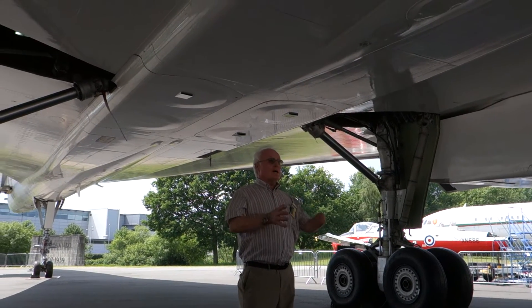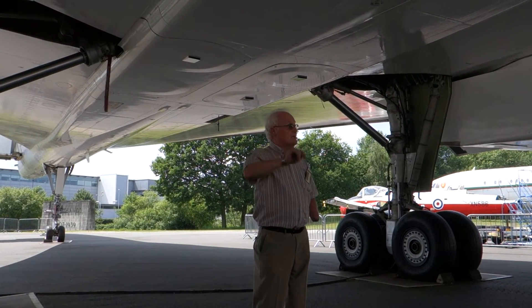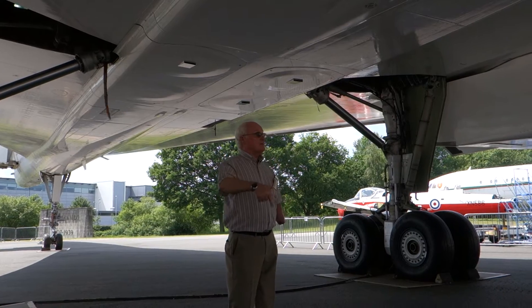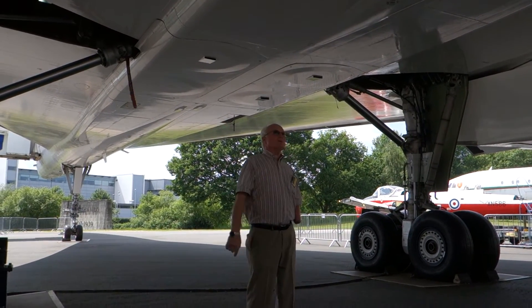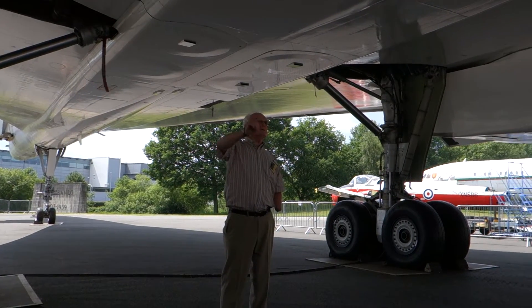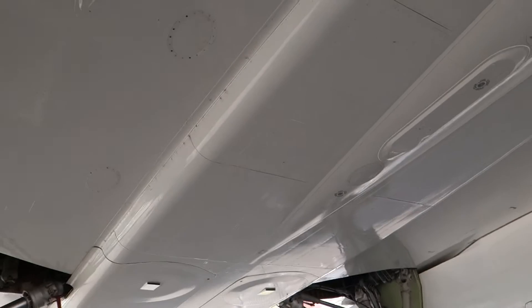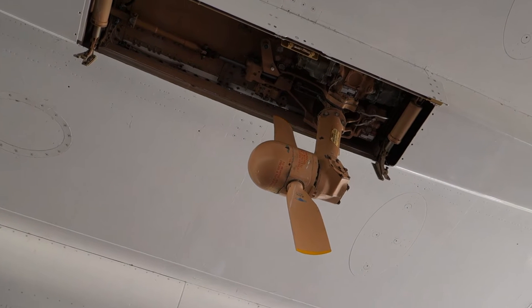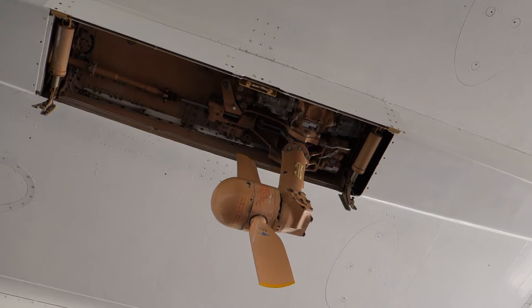So all together, all that weight would be 194 tons. The aircraft per se is 100 tons with 94 tons of fuel weight. We use 84 of that between here and in here. You can see that we put actuators and the hydraulic actuators for the elevons on the outside surface, on the lower surface of the wing, so we do not go inside the tank, thus reducing the capacity of the tank.